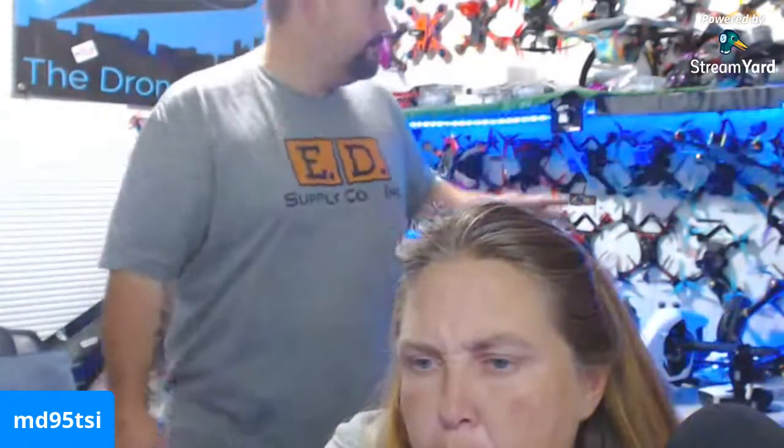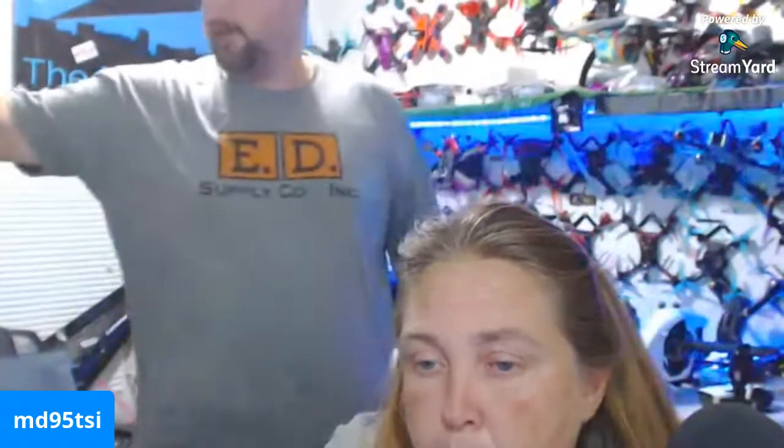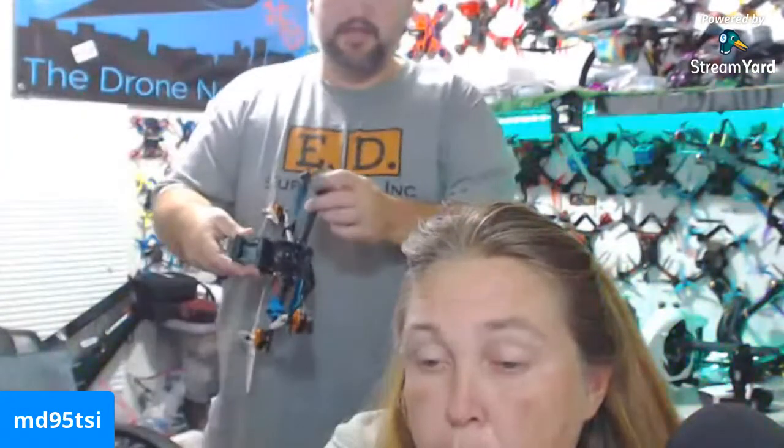It flies really good. But the Baduga was telling me that the boards in them are thin. The ESC board is thin in it. So if you got a tune that's crazy on it, high Ds, I could see it warping that board. And not just that, just out there running it. Probably on higher KV motors, because it comes through with 2150 KV on them, and this one here has got 1800. So I think that's where they keep the KVs low so they don't draw much amps, and that's how they keep the boards running.